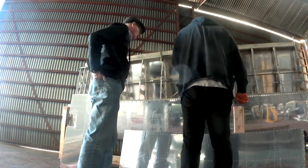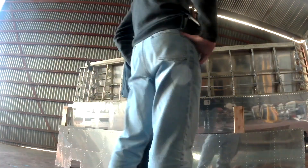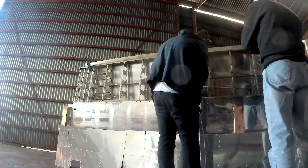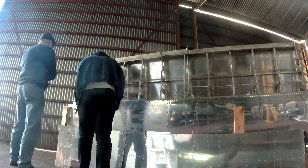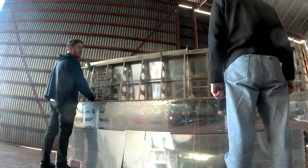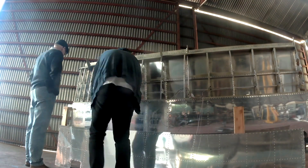Here you can see my buddy Ted checking out the wiring. This is a proof of concept for a few things: one, we're firing up the G3X in the fuselage; two, we're connecting it to the right wing — we'll drape a wire outside the panel rather than using the proper wing root connection, but hey, baby steps; and three, we'll do the magnetic interference test. We'll have the wingtip lights, landing lights, and everything running while we test the magnetometer.